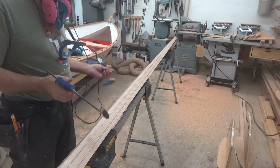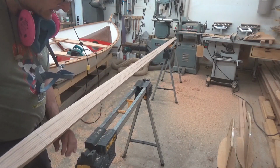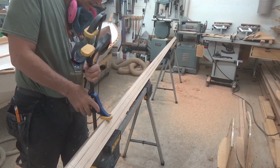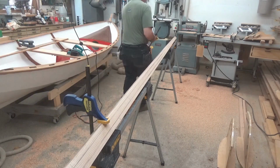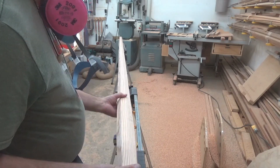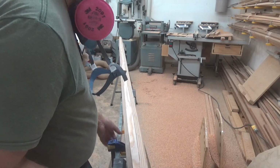Now one could make a little jig to set up in your blocks or in your sawhorses, but these convenient little DeWalts have the V cut into them, so it sits nicely. It will wobble around a bit, so I can just clamp it down in a couple sections and move my clamps to another area when I need to plane that area. Back to more shavings and noise. Now that I've planed 4 corners down flat, I've turned the 4-sided piece of lumber into an 8-sided piece of lumber, with relatively equal sides using the marking gauge.